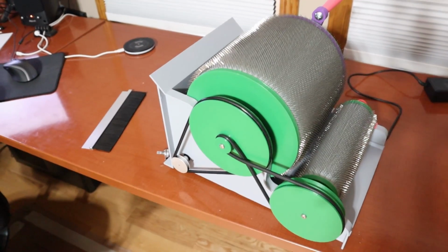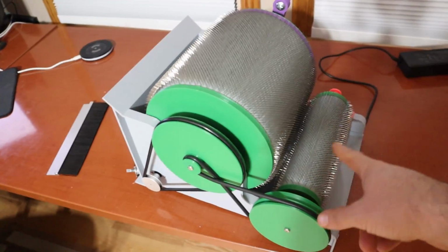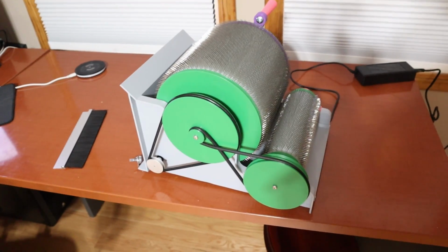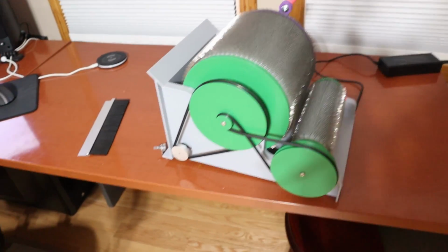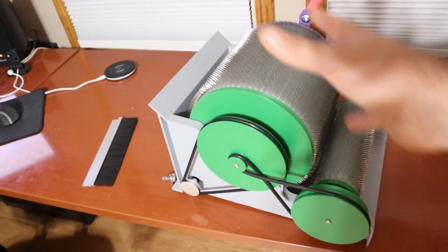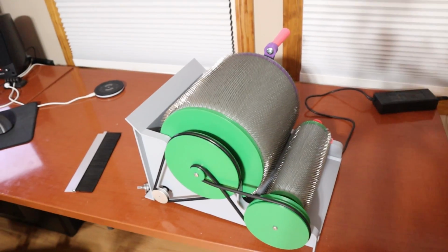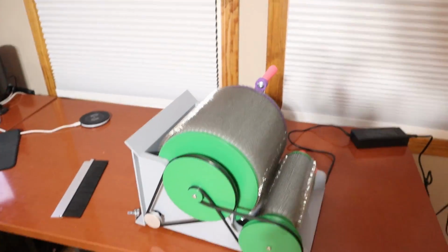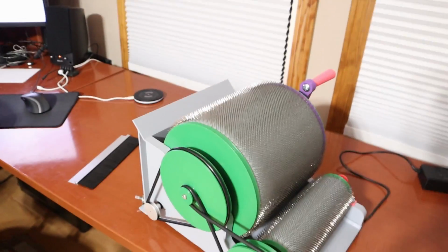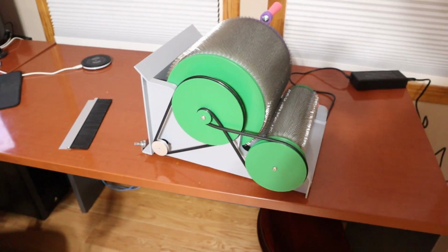And then the fourth drive option is to have this drum and this drum driven by separate motors. Then inside the electronics, you could completely configure the ratios. So I'd probably have two different dials, one to control the overall speed, and one to increase or decrease the ratio. That would give you the most configurability, but it also comes at an increase in cost. So I'm kind of interested in seeing which of those 4 drive options the community thinks I should go with.